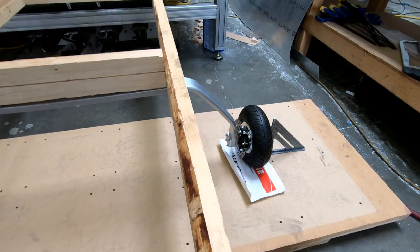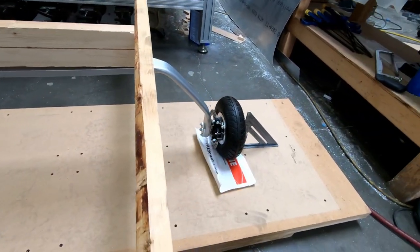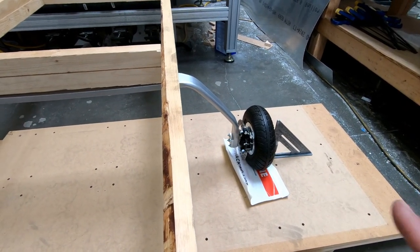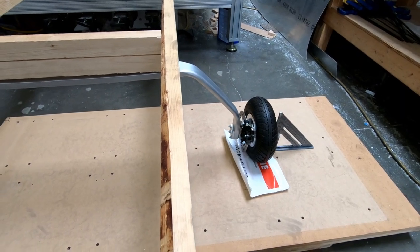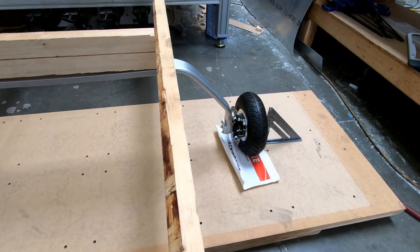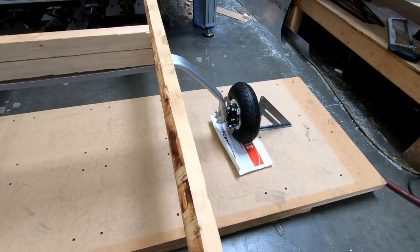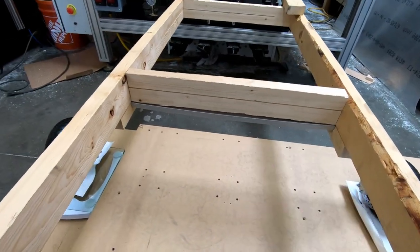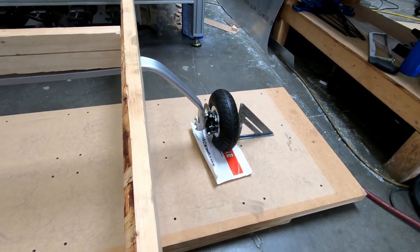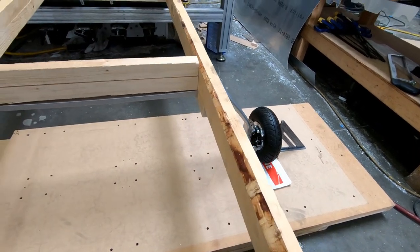So as far as this gear being stiff, yeah, it's definitely stiff, but I don't think it's too stiff. If it wasn't this stiff at gross weight, these wheels would start bending outward upon a landing. And of course, I want to have a little bit of extra on there in case we did the 1.5G equivalent drop test, which would cause those tires to bend out if it actually had to flex that much, and it would bend down more in the middle here. But I'm quite pleased that at gross weight, I should have these tires perpendicular to the ground. So I'm going to say this is good.